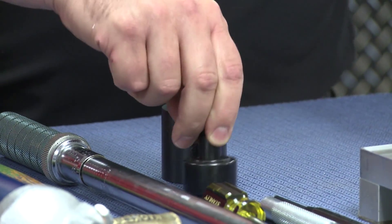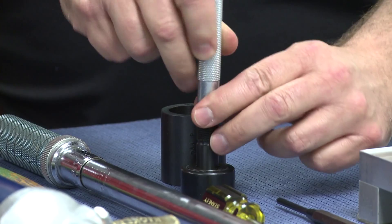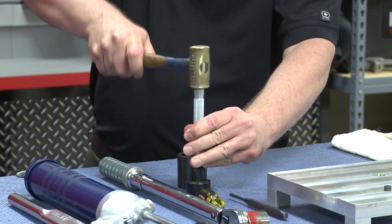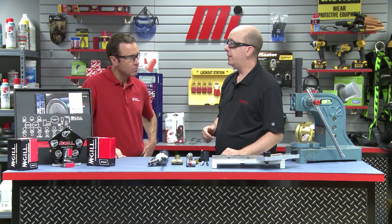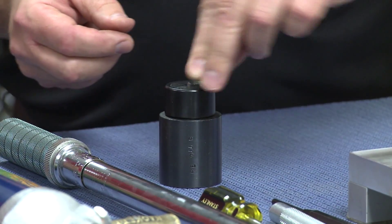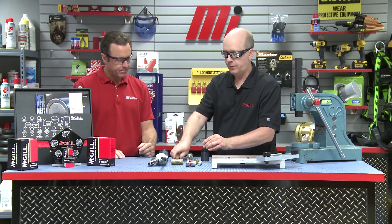The drive-type fittings can be installed with tooling made to allow driving the fitting without damage to it. The fitting can be driven using an arbor press or hammer. The plug can likewise be installed with a small drive pin or arbor. When installing the plug at the end having the screwdriver slot, we want the plug flush to the bottom of the slot so that a screwdriver blade can be used later to hold the stud. We'll use a punch and a few hammer blows.